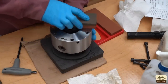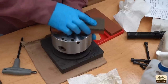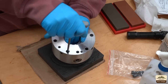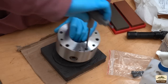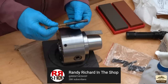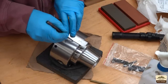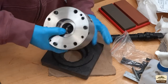And I'm giving the chuck the same treatment. Most times you will see high spots near around those machined holes. We want to take it apart and see what it looks like inside — it could be clean and ready to go, or it could be full of dirt and grit. I don't want to take chances, just take it apart; it doesn't take much time to clean it. I'm using Randy Richards in the Shop's special birthday present for me — a carbide scribe that he makes. I want to mark how the two pieces of the chuck are assembled so I can put them back together the same way, but later I found out it was unnecessary because this chuck has a register pin.